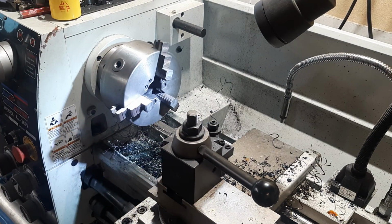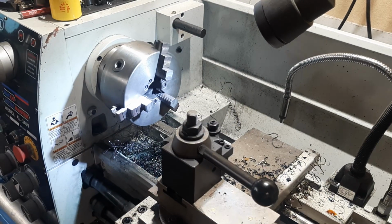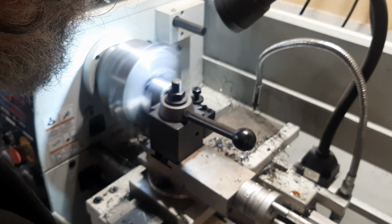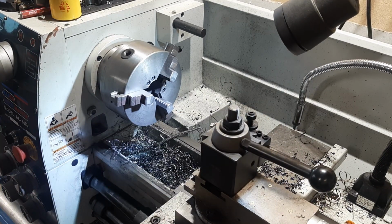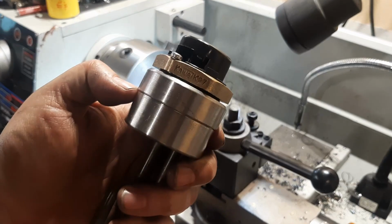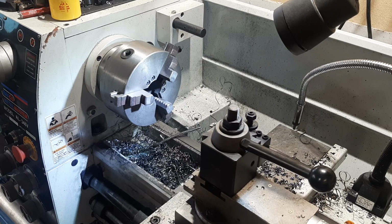That is going to work very well. The only thing I'm probably going to have to do is make the chamfer that the O-ring seals against much larger. So I'll do that now. And that's just a chamfer run in by hand. Plenty good enough for what it does. And now it's much tighter on that shoulder. So when you nip down on that, it'll squish that O-ring into that gap and seal up good and solid. So we are now that much closer to being done.